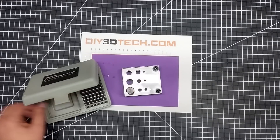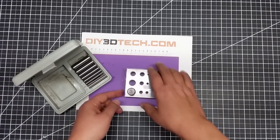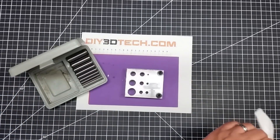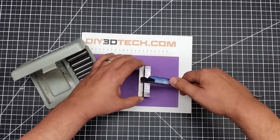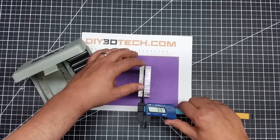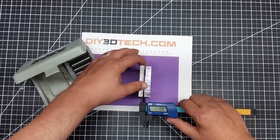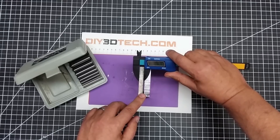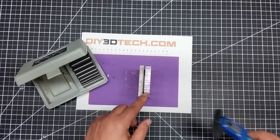What I plan on doing with this is actually creating a fixture to go inside of here. Something you guys will probably be interested in — and I needed to know for myself — is what is the actual gap. If I measure the gap, it's about 1.7 to 1.9 millimeters, pretty close to 2 millimeters. You could probably flex this a little bit to get up to 2 millimeters. So the base is about 9.7mm, the acrylic is about 12.6mm, and the gap is about 2mm.